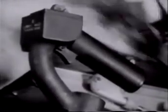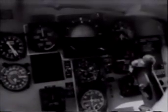In the cockpit, there is a change we should note. The control which adjusts collective pitch is called a thrust rod. To move the thrust rod, this trigger must be depressed to release a magnetic brake which normally locks the thrust rod in position. The magnetic brake can be forced or broken in the event of a jam. When making collective pitch changes, it is not necessary to simultaneously twist the grip to adjust power output. Power is automatically adjusted as collective pitch is changed. In addition to the standard instrument panel configuration, the Chinook is equipped with electrically anti-iced and defogged windshields. Electrical current passing through a conductive film between two sheets of glass heats the windshield to remove ice or fog.